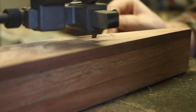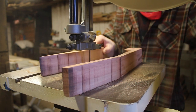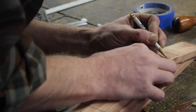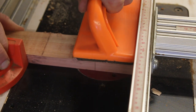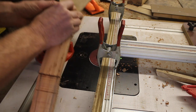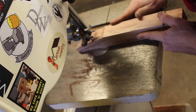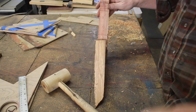There, I just popped my bandsaw blade and had to stop. You've got to be really careful measuring everything to make sure you've got the lengths and widths right. It's not hard — it's just careful and time-consuming. Here I'm just taking out from the block of the neck the thickness of the top piece of plywood so it'll all sit nice and flush, and I'm going to glue it all together right into that block. Then, much like the way you make a cabriol leg, I just hot glued the cutout back to the neck so I could have a flat surface and cut out the second side of the shape. The hot glue easily peels apart, and I have my neck blank.